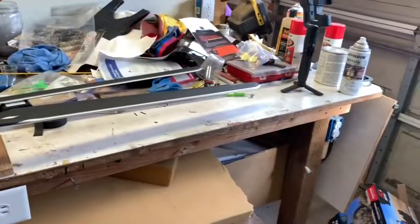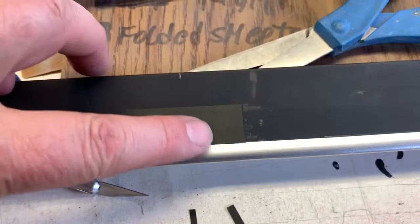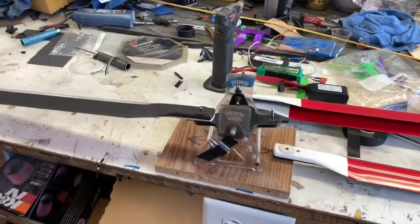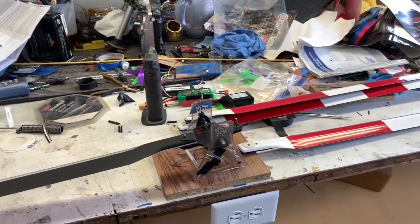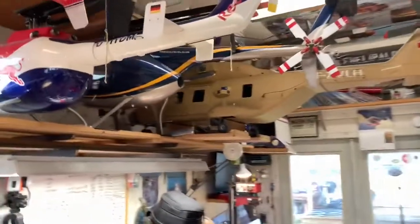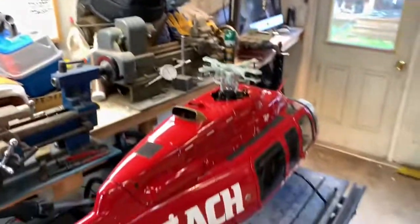You see this set — this is the one I just balanced on the time-lapse. It's all good. That was all I needed to balance it out, just a little tiny piece, unlike the other set that needed a big chunk. Now if I had a three-blade set on an A-star, or a five-blade set like on my 500, all of those blades have to match all the way around.